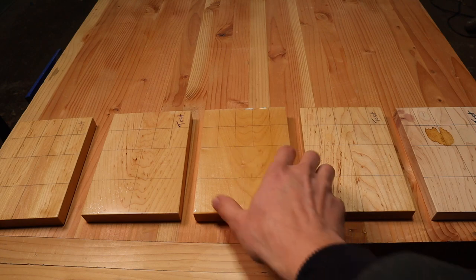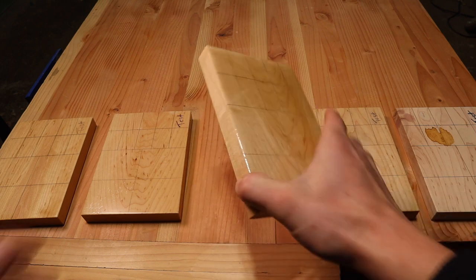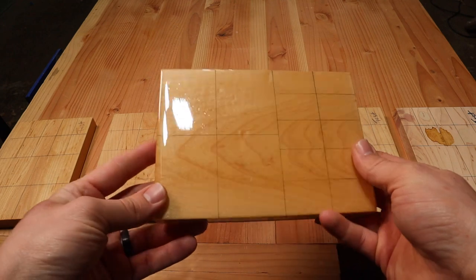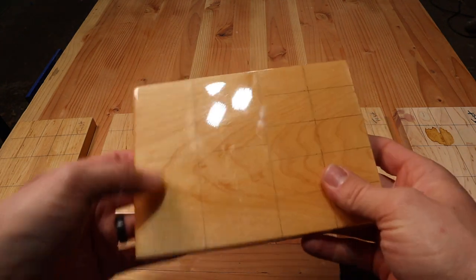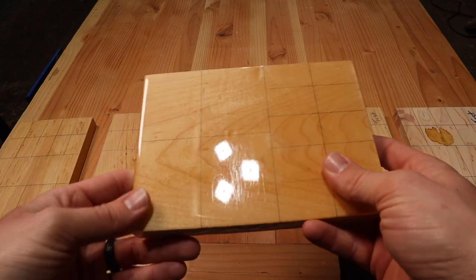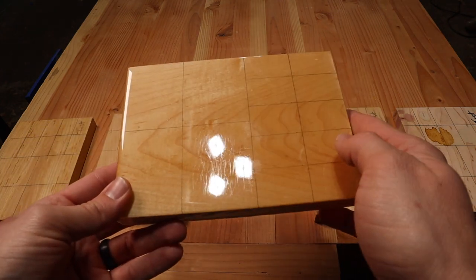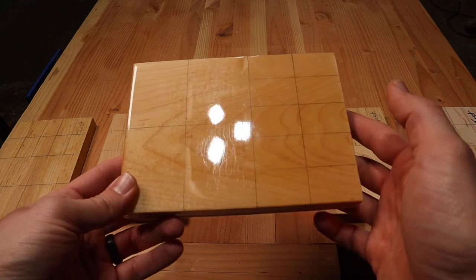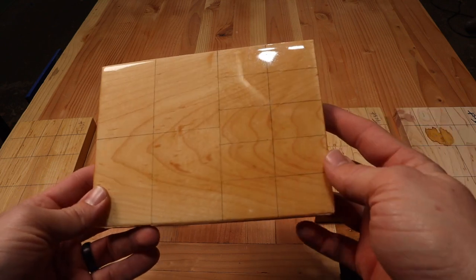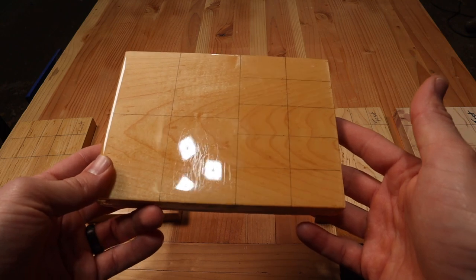It sustained the least physical damage, and it had no staining potential whatsoever with any of the stains that I tried. The only thing that stayed was the fork and knife, and the keys left a little bit of marking, but really the worst damage came from the fork and knife right here. So if you can prohibit people from using forks and knives in the way that I use them on these samples, the epoxy seems like it's going to be the best finish overall.